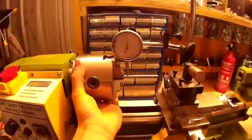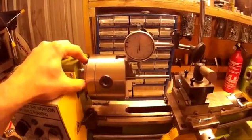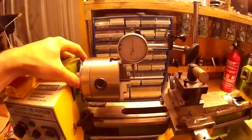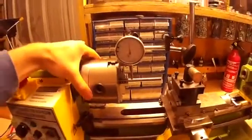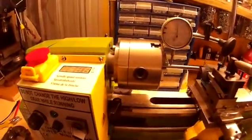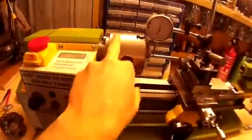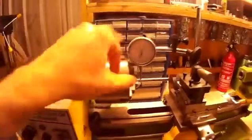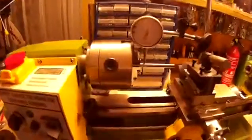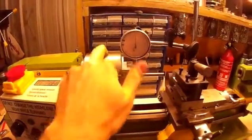What I've come to learn was that the actual back plate — or the face plate on here — the recess which fits into the back of the chuck is ever so slightly too small, so you've got slop side to side. There's about probably 1mm of side-to-side movement. The only way to get rid of that is to put your chuck on there, tighten the bolts ever so slightly, and then use a rubber mallet going around, using the dial indicator at the same time, until you get the chuck directly centered on the back plate.